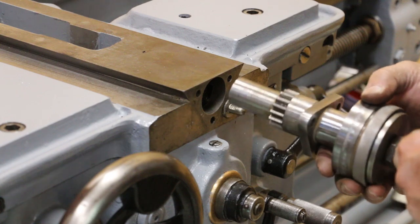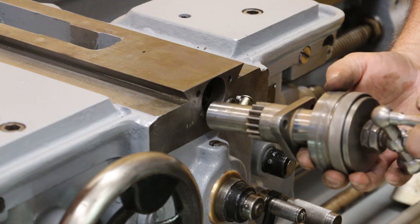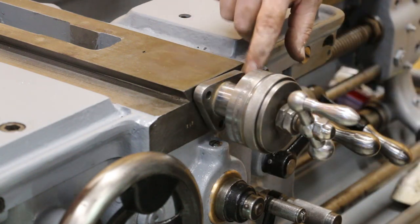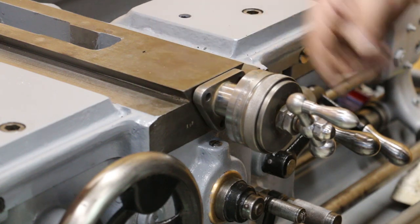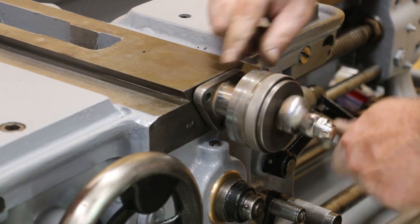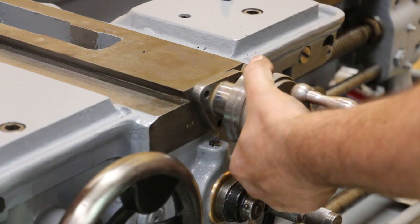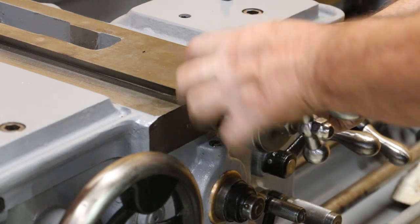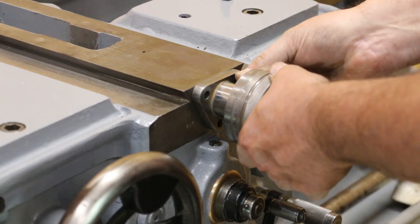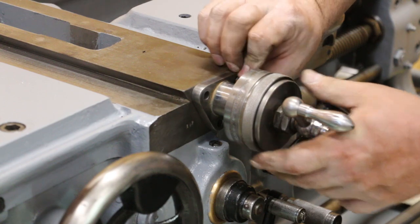Next to come in here is the actual dial and we've got this all cleaned up and polished up and it's just going to come in here. Now the way this goes, there's three holes that this could go into and theoretically you could put it on here anyway. But there's a line right here at the top that you're dialing into and you want that line to be on the top — that's your reference. There's just three little bolts here that tap into the casting.